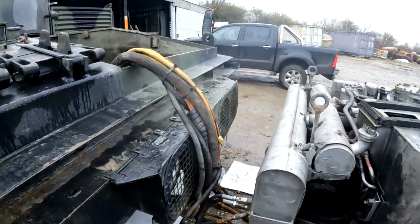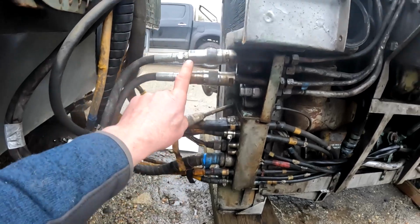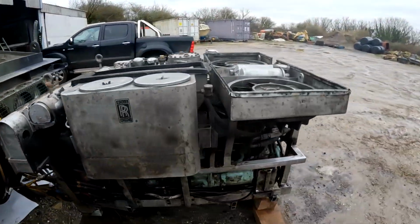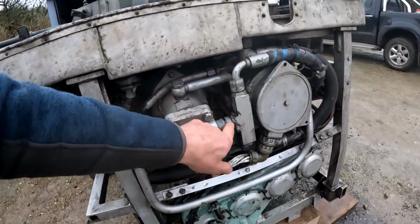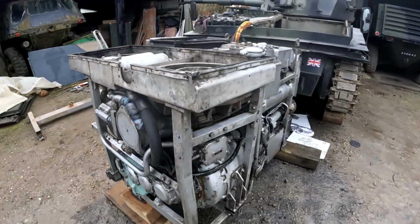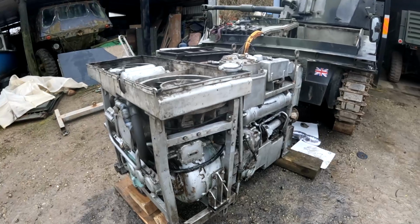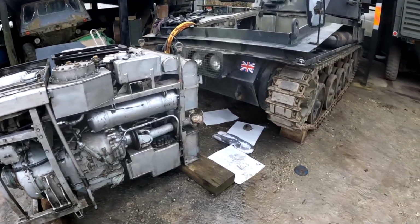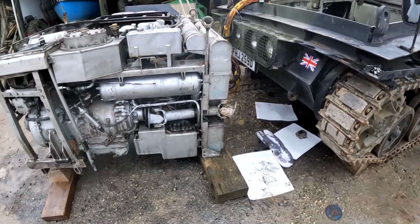And this is where all the vehicle connections take place. So this is your power here, all your controls which go to your dash, and this is your fuel lines. It's one of these that's actually leaking. We're going to have to replace this one. And I've also got 2 quite bad leaks on the fan pipes here and here. You can see I've tried taping them up, that didn't work at all. They're going to have to come off, and we're going to have to stop that because we are leaking quite a bit of oil and a little bit of fuel, which, although it's not a huge amount, it's just not very nice to go places and drip little bits of oil everywhere, which is quite common with these age machines. It's quite usual for them to mark where they've been. You can see here I've got a few little spill mats just to try and contain the oily mess which is coming out of them.